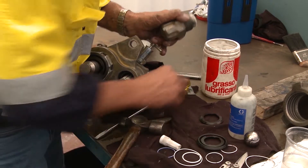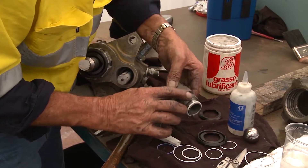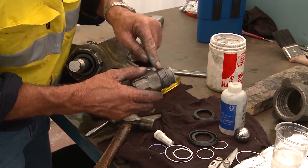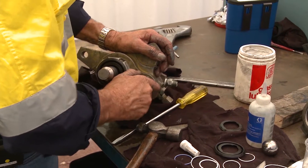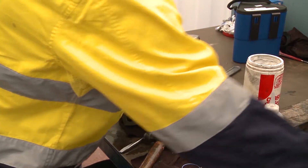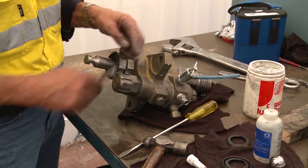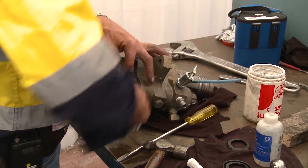Use the silver anti-seize that came with the kit — slide it onto the thread. I prefer a little bit of Vaseline on the o-ring rather than excessive anti-seize. Wind it onto the thread and it'll go all the way to the new o-ring and then stop. To get it past that, you're going to squash that o-ring into the taper — use your C-section spanner and tighten it up. Note that I put the filter housing all back together before reinstalling it, because trying to tighten it with the filter in place would impede progress. The filter housing is the last thing you put back on top of the pump.